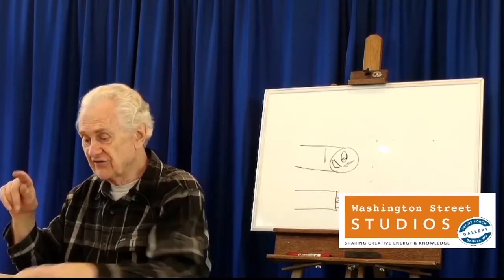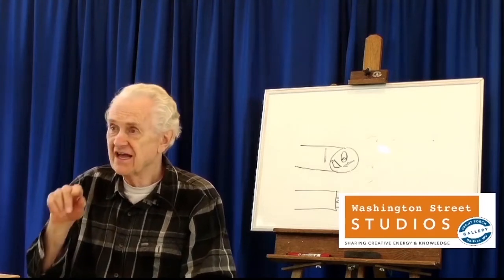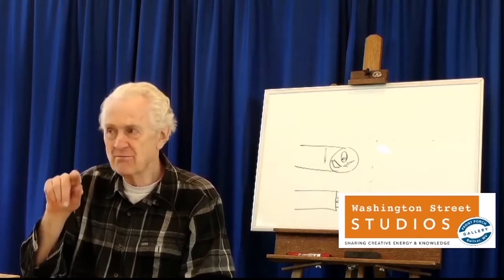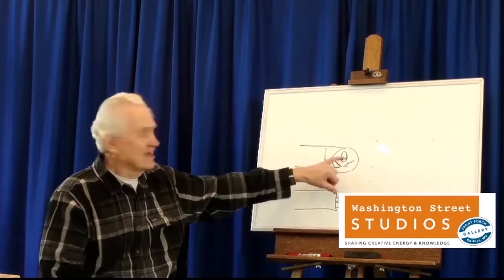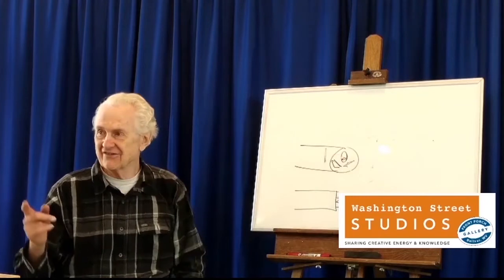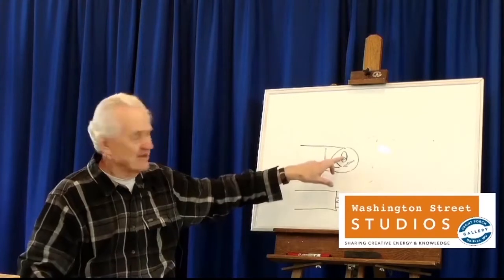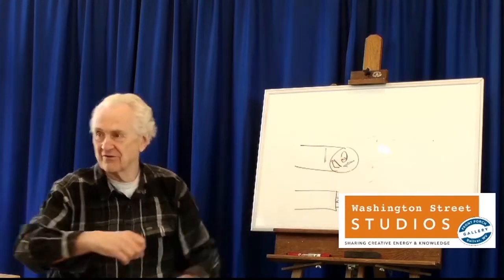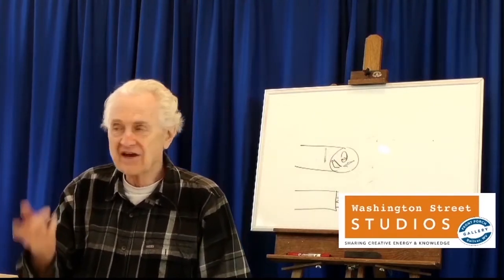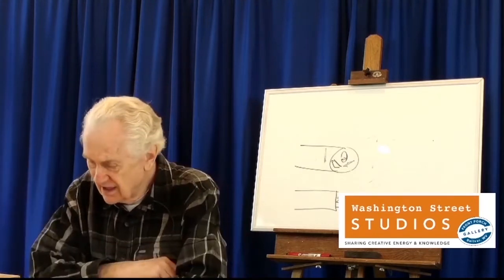We had a kiln at one of the studios where I worked, and it was in a shed outside. It was completely protected from the weather, but it was outside. We had a problem with the kiln, and I went to move the rod with my finger, and it wouldn't move at all because a mud dauber wasp had gotten in the hole and built a nest. It was the kind that lays one egg or something. I took the whole thing apart and cleaned it out, and there was a mud dauber's wasp nest, because we had a puddle there, a nice little spot for a nest. So the rod was completely frozen, and it never would have shut off. Corrosion can also impede that. So take your finger and flip it up and down. Make sure it's free.